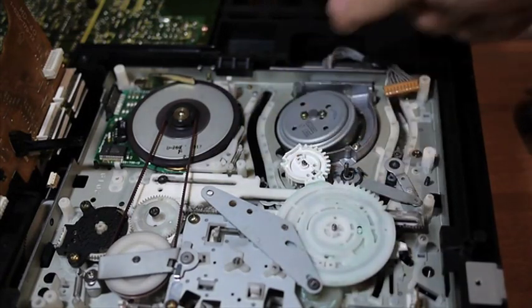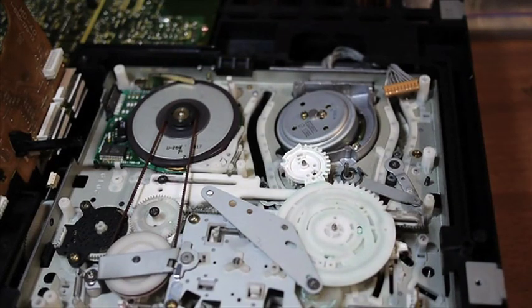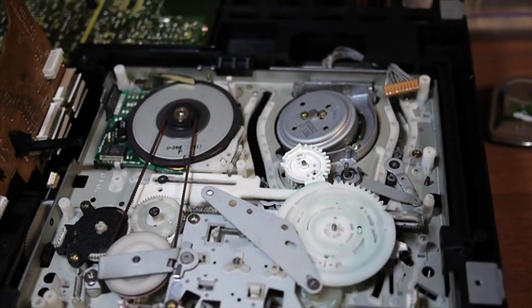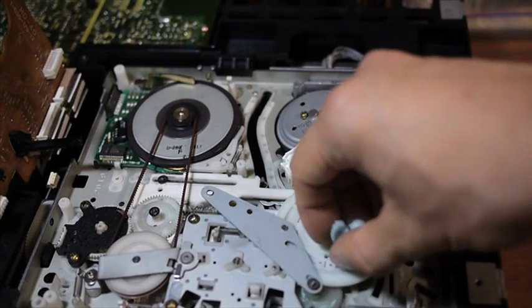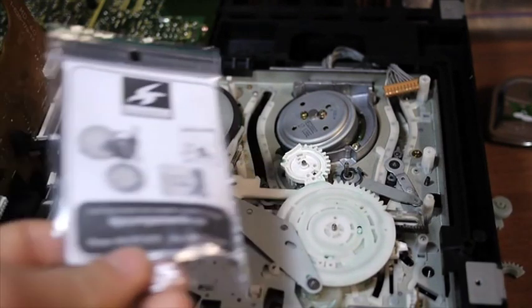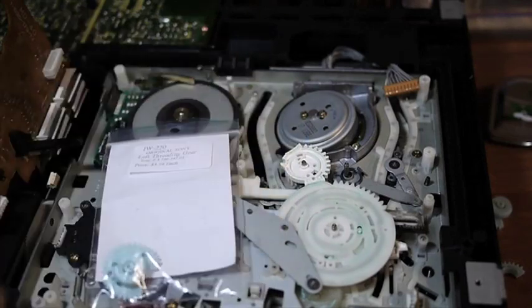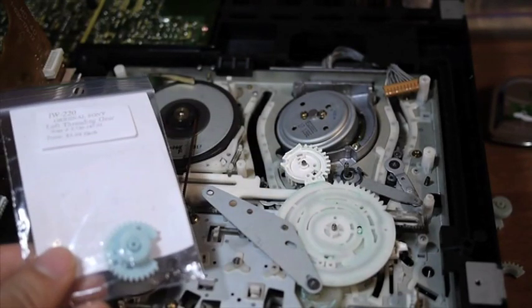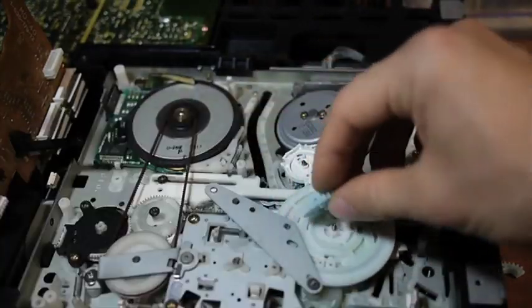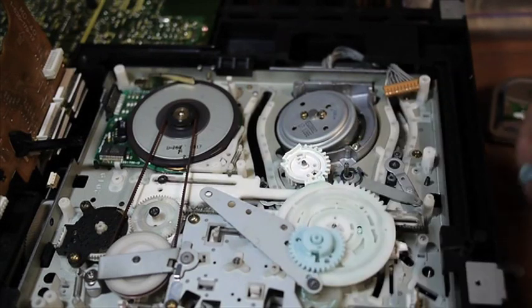I've removed some of the screws and clips holding these plastic gears in place — this is just for demonstration purposes. Initially I thought it was impossible to find a part like this that is very specific to a 20-year-old VCR. But after further research on the internet, I was able to find some companies still selling this particular gear among many other parts for older electronics. One of them is KP Components of Canada, and they were quite prompt at shipping my order. So here is a new gear, which is identical to the broken gear.